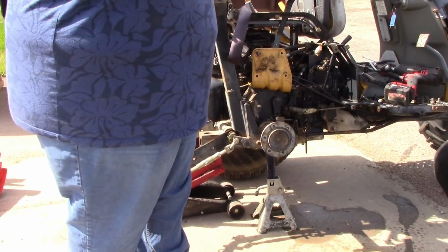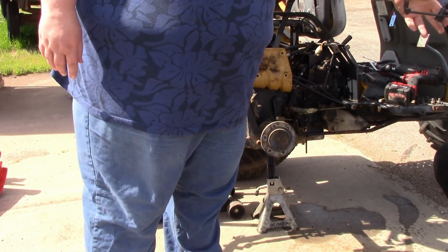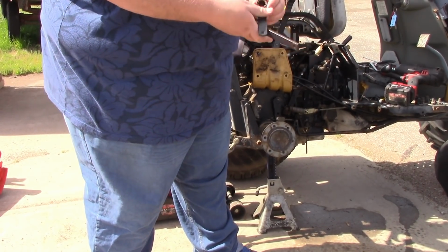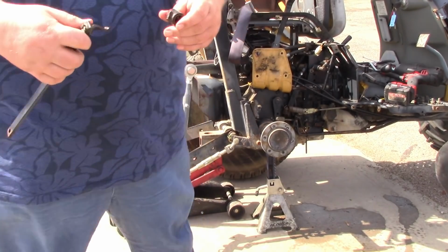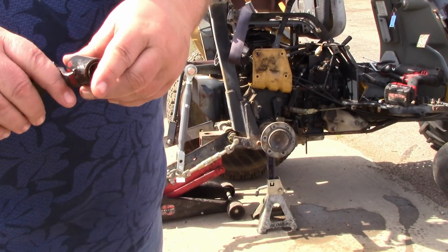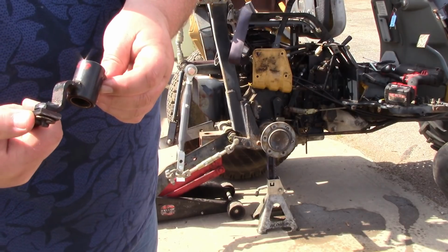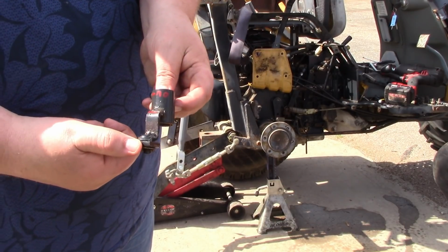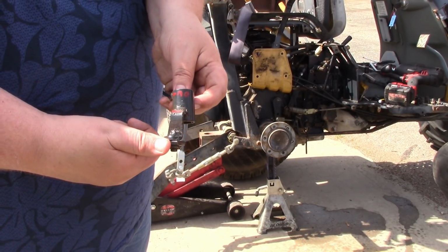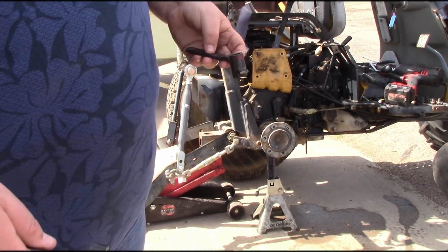So guys, Junior Mint got the fender off, and he's been lubricating stuff up in there, but he's got the broken piece off. Let me show you what we got. It came from right here. That's the lever for the high-low, and the linkage is broke. That piece is supposed to be hooked to this piece, and it snapped. So I'm going to send him in to re-weld that and see if we can get that put back on here. Let's see what he can do, guys.